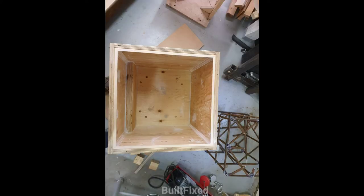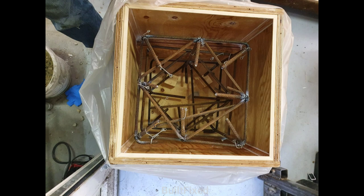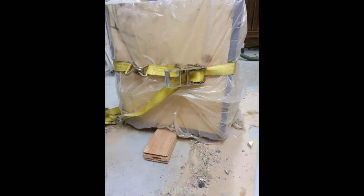To raise the height of the crane I created a reinforced pillar. I did not want to have any sharp edges so I used cove trim down inside to create a radius. The entire form was set down into a large plastic bag and when the pour was complete the plastic was wrapped over the top. Then once a day or so I would add water.